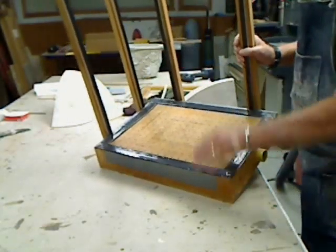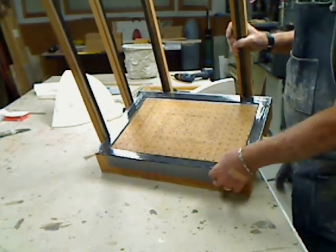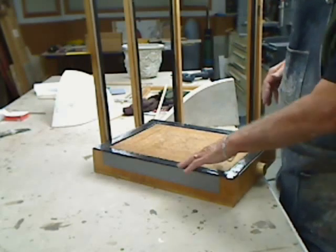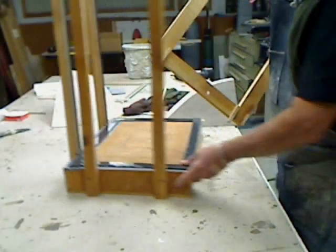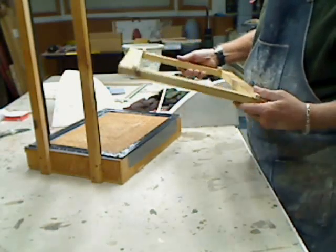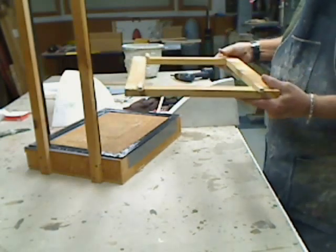On the top, depending on the size of the frame we're going to be using, I lay down an inch-and-a-half-wide weatherstripping to give a cushiony feel for the frame to go against, and then I cover that with packing tape because when you bring that hot plastic down, sometimes it tends to stick — but it won't stick to the packing tape. This is a frame, just a simple construction out of wood, screwed and glued so it's good and strong, with little extensions on there. Depending on the size of your oven, this is the maximum size frame I can use in my oven. I slide it in and these little extensions run on the rails inside that hold your oven rack, and this supports your frame.